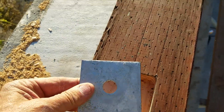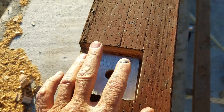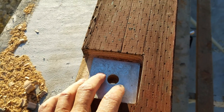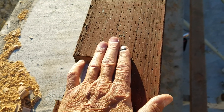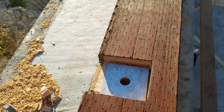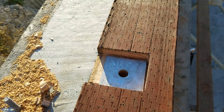These are the square hold-down bolts, and I'm sinking them down enough so that the plate washer — this is the square plate washer — and the bolt will be below the surface of the mud sill, so that when I mount the trusses and the rim joists on top of the mud sill, I don't have to do too much work to get them to fit.